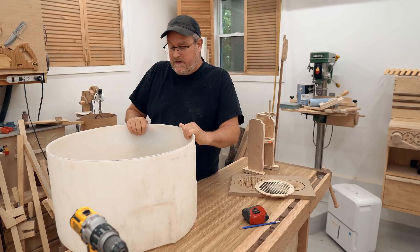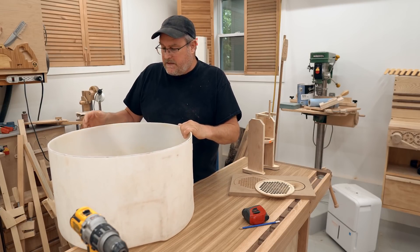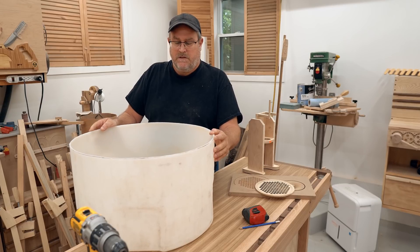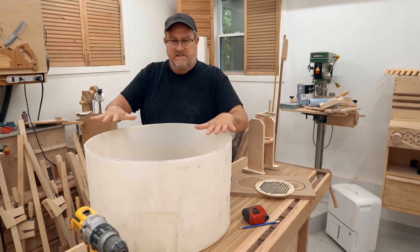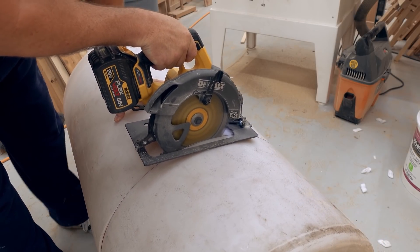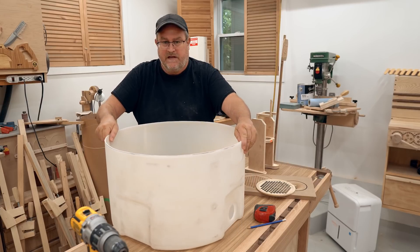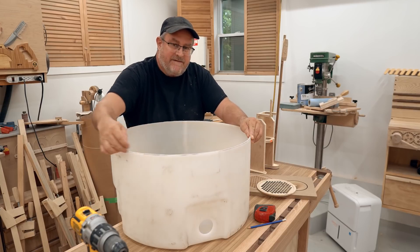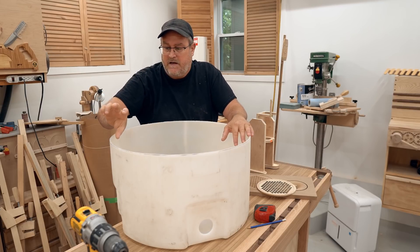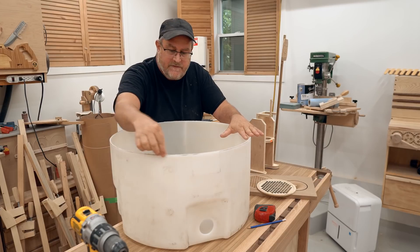So I'm also working on another project: an old water tank that I cut the bottom out of. This is going to be a thien baffle dust collector — this is the collection bucket that goes on the bottom. I cut this out roughly with the skill saw, but I'm going to set up a jig so I can use my trim router on the workbench, rotate this around, and the router will cut it nice and flat. From the rest of the tank — another 40 inches — I'm going to cut another ring so the thien baffle sits down on top with a groove for this bucket.